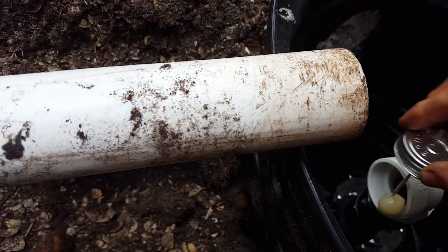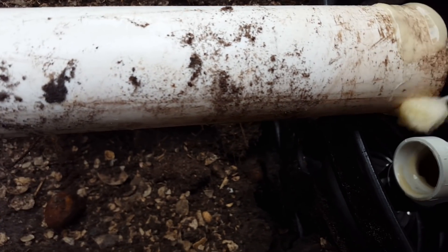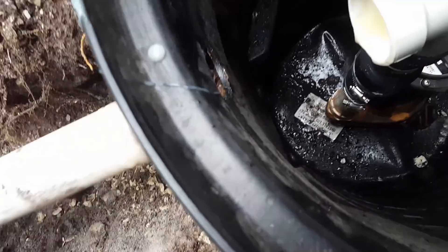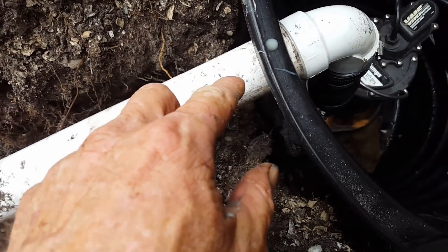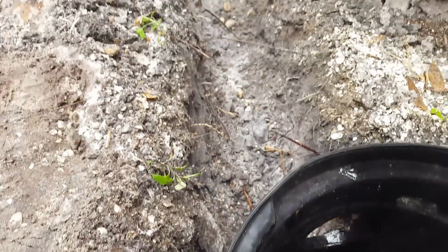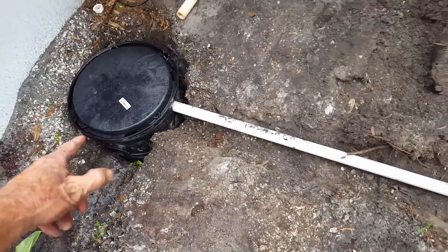It lines up perfectly with our discharge so we're able to slide this inch and a half directly through there. We'll cut that and change it to two inch just outside the sump pit. Get a good amount of glue on here and slide it right through. We've got our first piece of the inch-and-a-half discharge — it's going to go on out down through the trench. Everything's plumbed and ready to go. We just need to finish the footer, the French drain around, hook it up, and we're almost done. Our discharge line is installed.